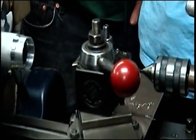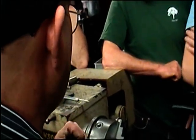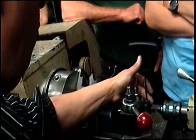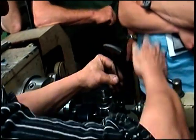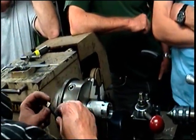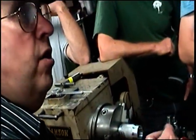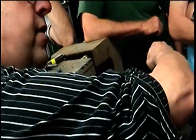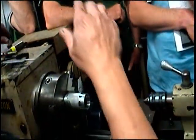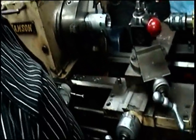Making sure you are going to get your tool on center is very, very important for another reason. If my tool is above center, I will not be able to take all the way to center — you will start rubbing on the front face of the tool before you get to center. If it is below center, it will pass under center. Both of them will leave a protrusion on the face — the machine shop term for it is a 'tit.' It's not acceptable. So you want to spend extra time making sure you can get your diameters right, for being able to turn accurately and face properly.